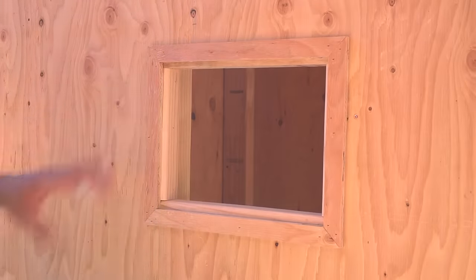There are numerous reasons why I'm going with a stain over a paint, but the most important one was that I wanted something durable that was not going to peel over time — and stains are generally much less likely to peel than paint. The stain I'm using is a solid opaque finish and it was extremely thick, which is why I did have to thin it out a bit before using this sprayer. As you can see, it made quick work of getting into all those tight knit crevices. This sprayer really did make life a lot easier, and with the QX5 having so many different settings — whether it's horizontal, vertical, or spray pattern — I was able to get into all those tight knit crevices that would have taken me five times longer with just a paint brush.